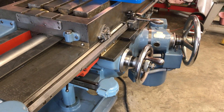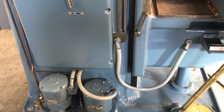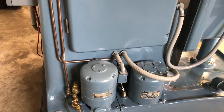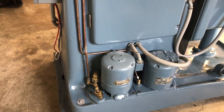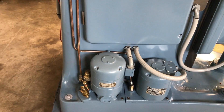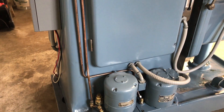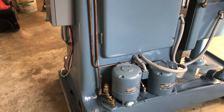This machine also has another rare option — from looking on the internet it seems to be rare — it has a factory air pump. This pump worked alright when I first got it but could have worked a little better, so I ended up boring it out a little bit. It's only a two-vane pump, so if you have clearance between the rotor and the outside housing it will just push the air in a circle and not pump any air at all. I ended up having to put a sleeve in it — I turned a cast-iron sleeve and pressed it in — and now if you restrict the flow it'll make about 20 pounds of air. The manual says it'll make up to 30 pounds but I haven't been able to get it that high. I think 20 pounds will be plenty.